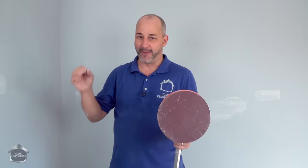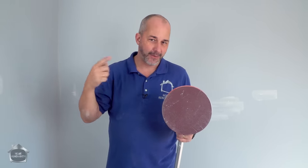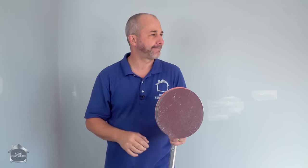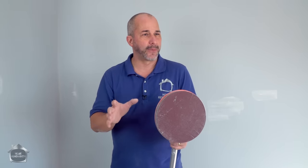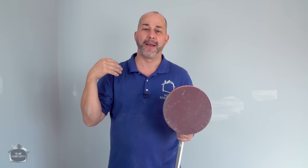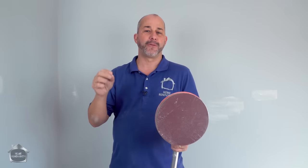When you sand your drywall the first time, you're gonna have a bunch of dust left on the wall. When you're adding your primer, that dust gets mixed in with the paint and it becomes part of the solids content of the paint. Now that's a fancy word for high quality primer has a lot of solid content. Okay, so having dust on the wall just means you're gonna make your paint even better. It's gonna make it much more solid white and less transparent. And that allows you to see all the imperfections. It'll also fill in a lot of hairline scratches left over from sanding.